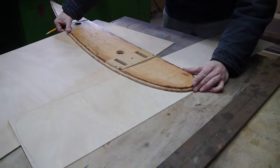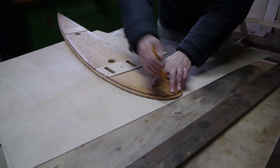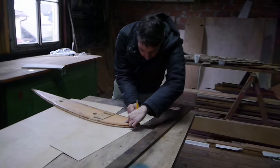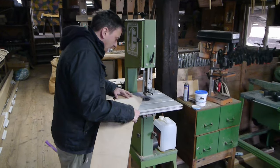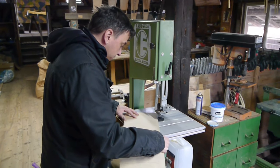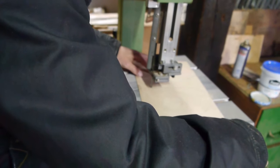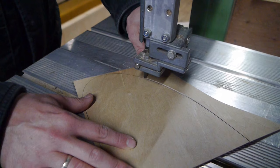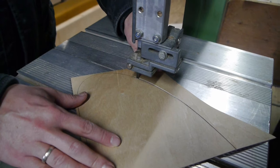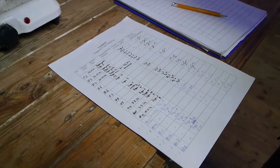The expert would like the so-called compression ribs — the box ribs or double ribs — to be constructed such that the respective outer layer of the three-layer plywood points in the direction of flight. On the Fokker aircraft they were arranged vertically on all ribs. We had also built the first ribs this way, but because the expert wants to absorb the pressure moment better, we will discuss this again later — Stefan is currently making new ribs here. Naturally, everything is properly documented during construction. Paperwork is important, especially in Germany — we Germans are only happy if we can fill out forms.